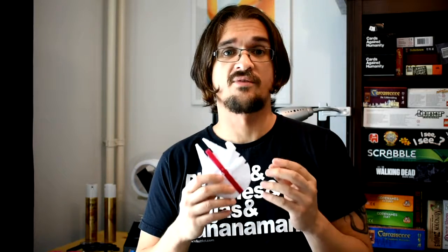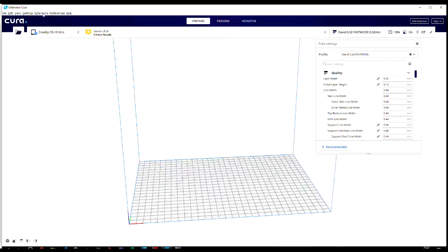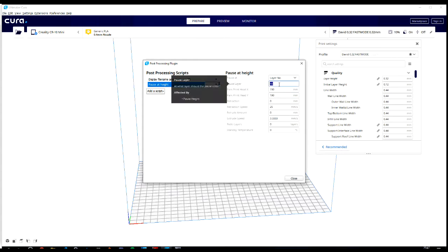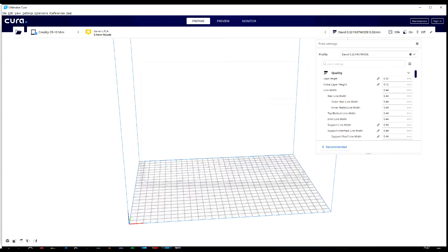I'd seen the Pause at Layer Height script on Chuck Hellebuck's video — I think he covers it, and if I can find the video I'll link to it down in the description. I actually tagged him on Twitter when I was printing the calibration cube, because I love his calibration cubes. The Pause at Layer Height is compatible with OctoPi and basically allows you to pause until you, as a user, go in there and resume the print via OctoPi. So I set it to pause at layer height, pull away from the print, home its nozzle on the XY axis, and that gave me time to swap the filament. I also set it to reprint one layer, which basically allows for better adhesion because you've obviously given it some time to cool, and by reprinting the top layer you sort of allow it to adhere properly to the next layer.